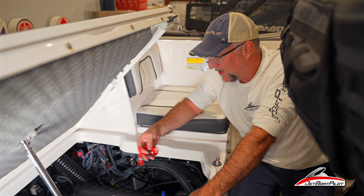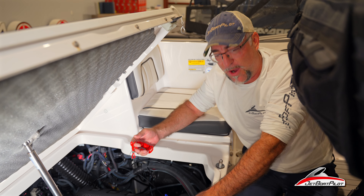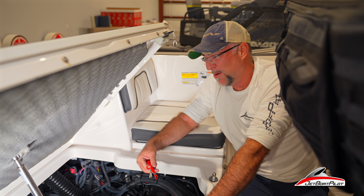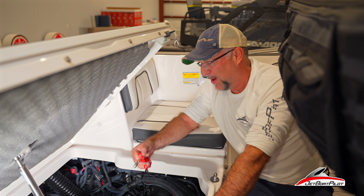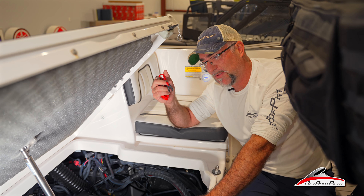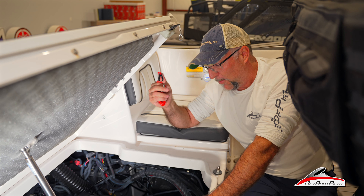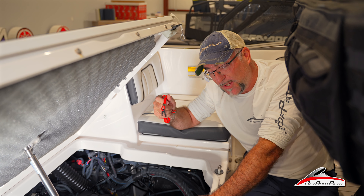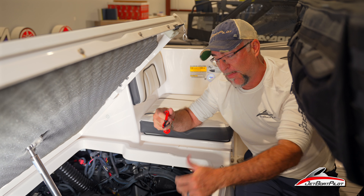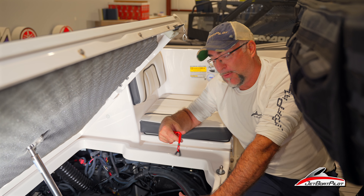Some have actually gone through the process of installing ball valves, which is not necessary but if you want to do that you can — it's a lot of extra work and you may not ever use this. But once again, you have to have some kind of redundancy so you don't forget to turn those back open when it's time to go boating. Otherwise you're robbing your boat of cooling water and that could be a problem.